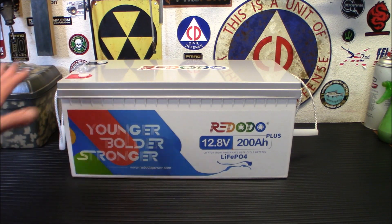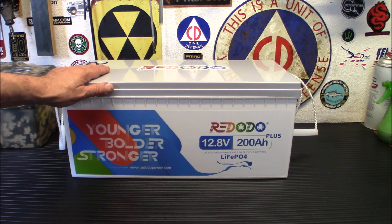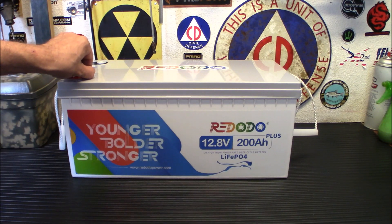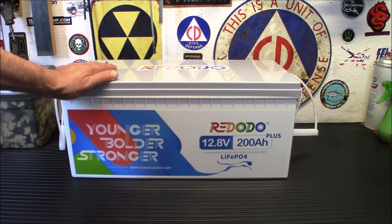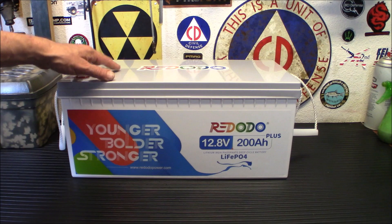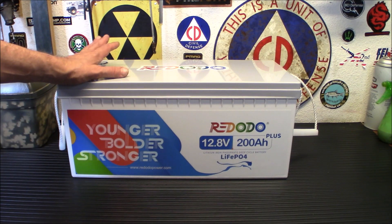The manual is very detailed, so don't worry. You do have a 5-year warranty on these — anything that goes wrong, you call them up. There's 24-hour quick response; they'll ship you a new battery or give you tech support. You do need a special charger set up for LiFePO4 batteries — it probably charges between DC 14.2 to 14.6 volts and at a higher amp rate. Otherwise you'll be sitting there for three days with a typical car battery charger. We're going to be using solar to charge this, which is the plan.